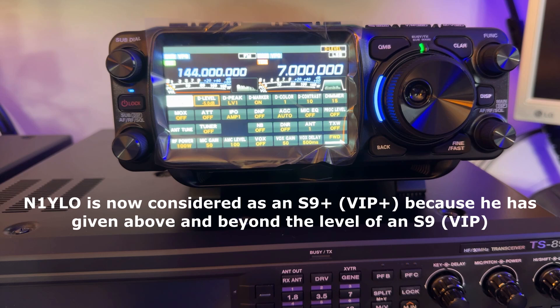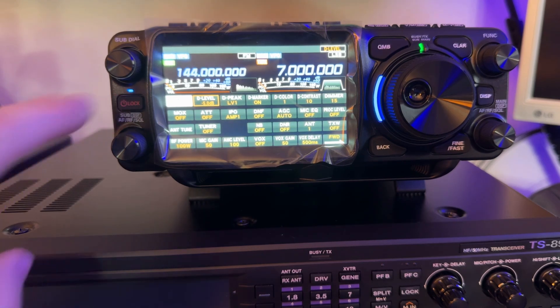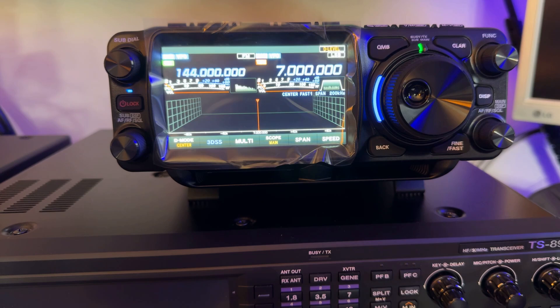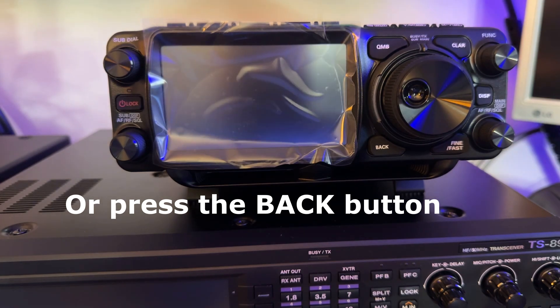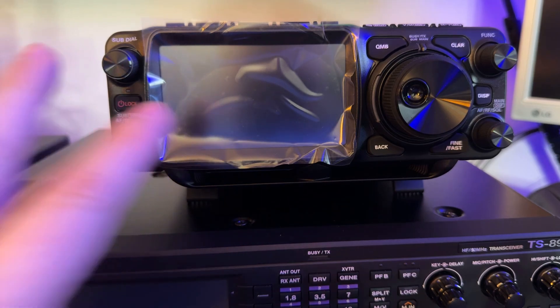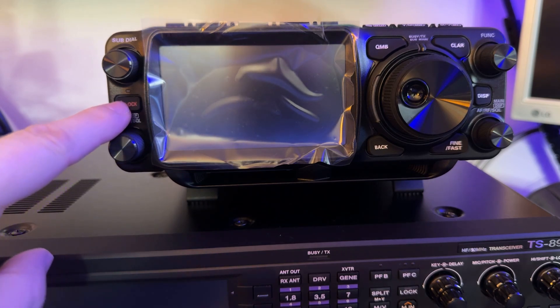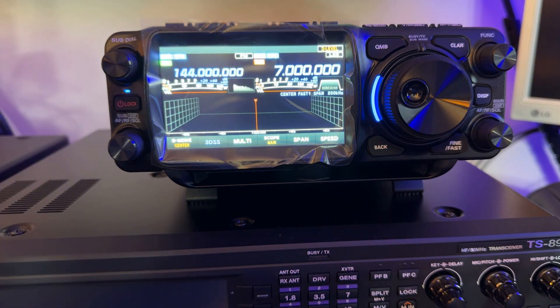I hope you found this helpful and informative. Not much in this one — unboxing it, powering it up. What's interesting is that it powered up just by turning on the power supply. Long press the function knob gets you out of the function menu. Long press the power button turns it off. Interesting though that it just turned on — these radios are what I call soft-start. When they have power available, even if they're off, there's a circuit in there looking for this button to be long pressed, and then it will power up the radio.